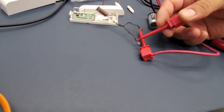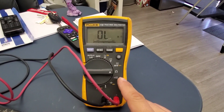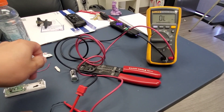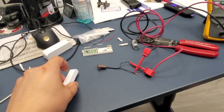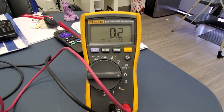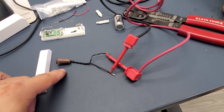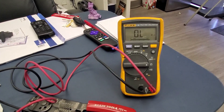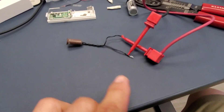We're still on ohms, we're open — megs. I have a magnet already installed up there, and as soon as I introduce it — right there — point two ohms. So the magnet, the door switch, we're getting the same reading. Take it away: open again. Put it back: point two. Perfect.